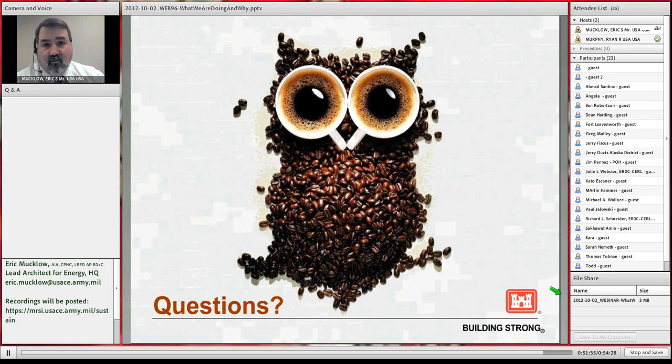Now, granted, natural gas is really cheap right now, but even when it wasn't a couple years back, I saw some life cycle cost analyses that had costs for going up and cleaning photovoltaic panels, which most likely would not be something that would be done. Certainly not at the frequency that they had. I think it was like monthly or something. Generally, you have rain. Rain will wash the things off, but there will be some dust that'll accumulate on the system. But you just derate the panels 5% for their power output, 5% max, based on what you expect for the fouling based on dust and debris.